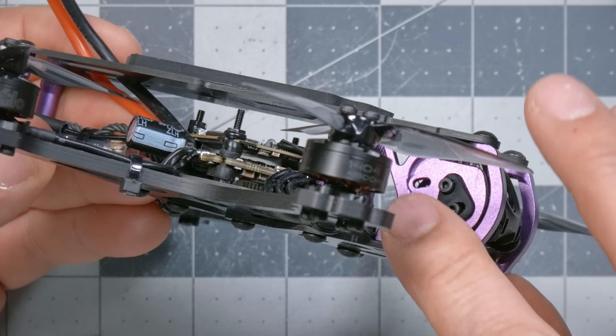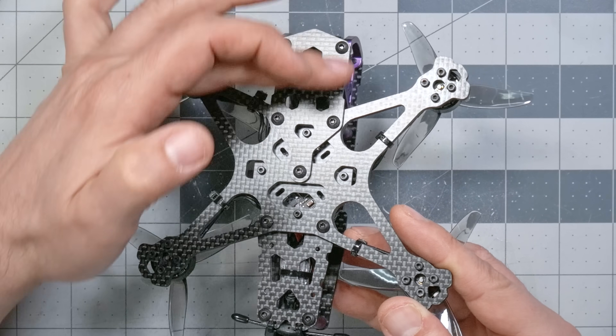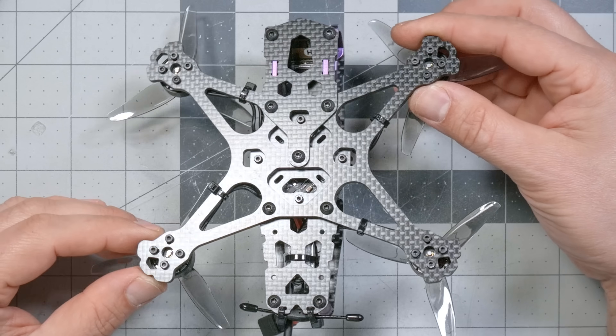We've also got a metal front end which improves durability and simplifies camera mounting, though it added a little bit of weight. I'm particularly proud of the way the motors mount on this frame. The motors mount to one plate, and the rest of the bottom plate is in the front and back. This addresses a problem with small quadcopter frames: the lightest design is a single-piece carbon fiber bottom plate, but when it breaks you have to strip the whole quadcopter down. On the other hand, individual slotted arms add weight and complexity, especially on small quads. We think this design really splits the difference very well.